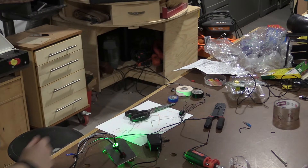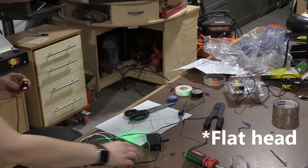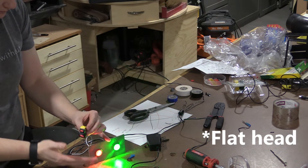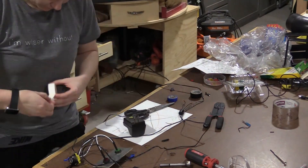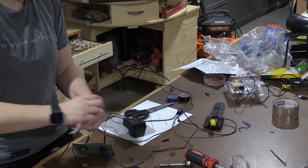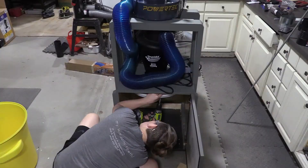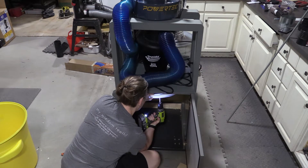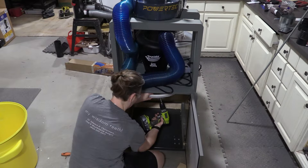There's a Phillips-style screw on the top of the sensor, and by screwing that in or out you can make the sensing distance be further or closer. I set it for about 4 inches on this one. On my big barrel I have it set at about 8 inches, simply because it's so heavy that I want to empty it a little bit sooner. After checking it, I just wrapped everything tight with electrical tape. I recommend drilling your 3/4-inch hole before you get everything set up in there, but of course I wasn't thinking, so I just drilled from the bottom up — it worked totally fine.